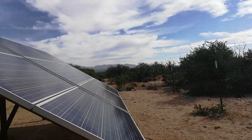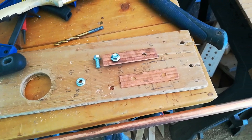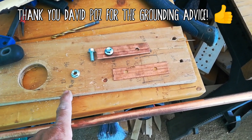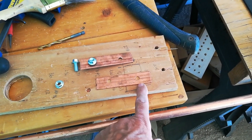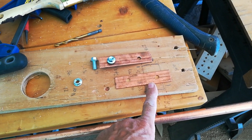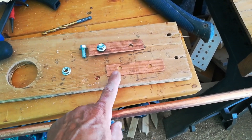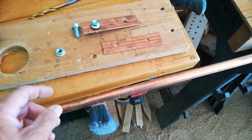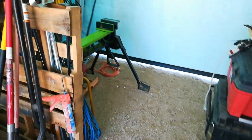The next thing on the list is to ground the array. To ground the three strings of panels I need strapping material to connect them. Each string is mounted on unistrut and grounded unto itself, but I have to connect the first to the second and the second to the third, then mount a grounding lug and run six gauge bare copper wire to a grounding stake. To make the straps I took some half-inch copper tubing, cut four-inch lengths with a pipe cutter, then flattened them in the jaws of a jaw horse by stepping on the pedal.